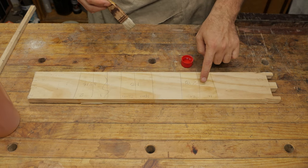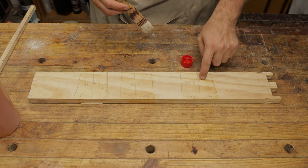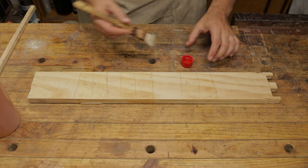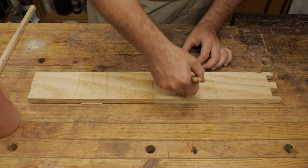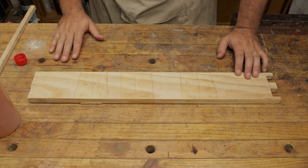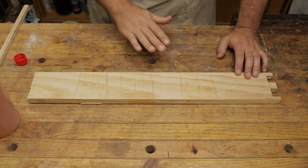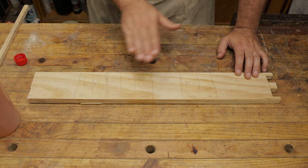You can already see that this is a much thicker coat going on, but it still dries relatively quickly — especially that first coat because it really soaks into the grain. It's dry to the touch now, and there's our second coat. I'm going to leave this for about five minutes, then give it a quick light sanding with some 240 grit sandpaper to make sure it's all nice and flat, and then we'll apply some stain to compare the differences.